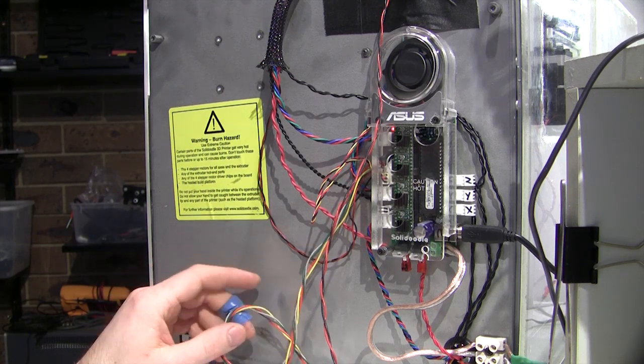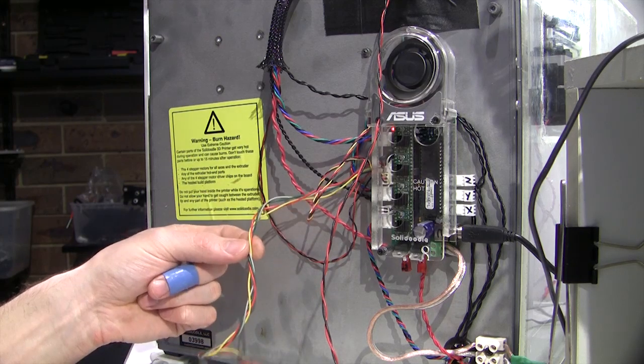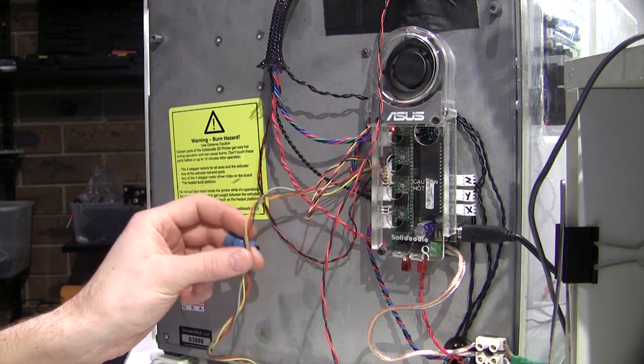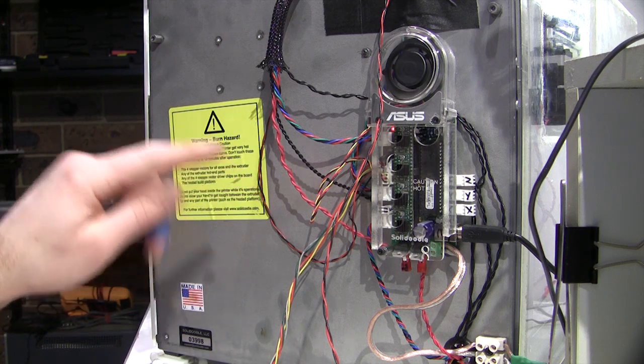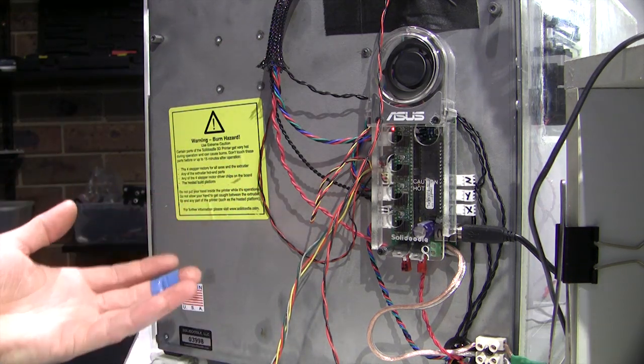But preferably get a multimeter and measure across all of these guys, and it will tell you, or even look up the specs and you'll be able to work out which are the two coils, because these are bipolar stepper motors, so you have two coils and you'll be able to measure resistance between two wires and nothing between the other two.